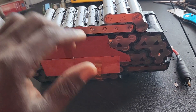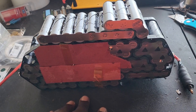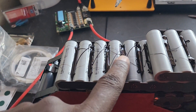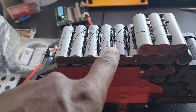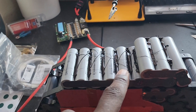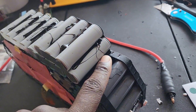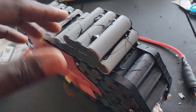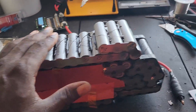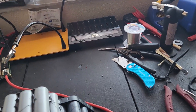All right, so here we are — we have a finished 72 volt battery pack. This was actually a 60 volt battery; my mistake, I thought it was 52 volt. You can see we have some industrial hot glue — believe it or not, the companies that people rely on and highly think of use the same type of glue when they use cell holders, so there's no difference. I also have a better spot welder and iron, and a charging station to charge these cells.